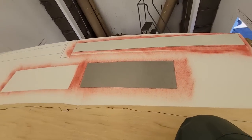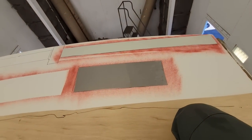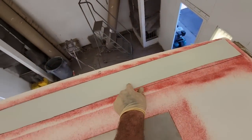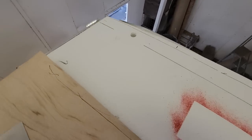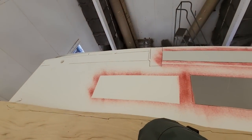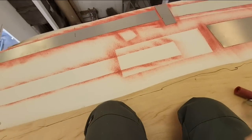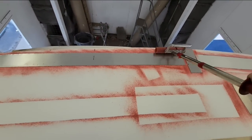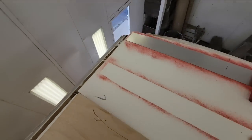Now, because Winnebago chose not to put metal underneath the ladder so that the anchors had something to bite into, we did see a leak right there. So I'm putting metal here, put metal right there so the rear cap has more to bite into than just eighth inch paneling right here. I don't know why Winnebago doesn't do this more often, but here we are. It's not a great deal of effort. Winnebago does do it periodically. I just don't know why they choose when and when not to do it.